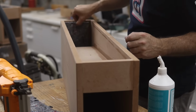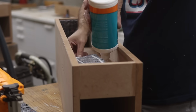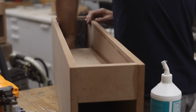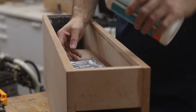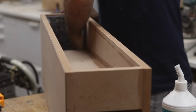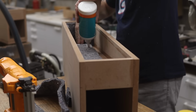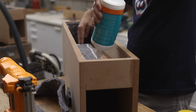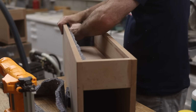Parts of the enclosure on the inside is lined with 12mm or half inch under carpet or felt sheet. This is why I have not yet secured the baffle in place. I am also positioning some Dacron damping material in a few key places. They all aid to tame certain parts of the frequency response and tune the bass to some extent. However, mostly the mid and higher frequencies are affected with the placement of the damping material in this case.